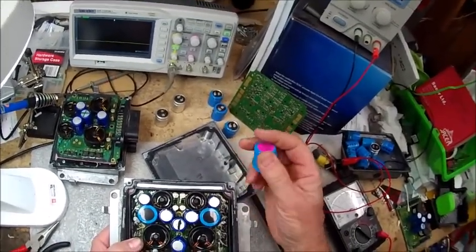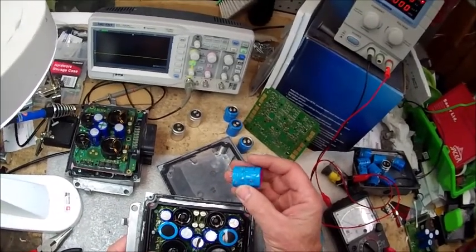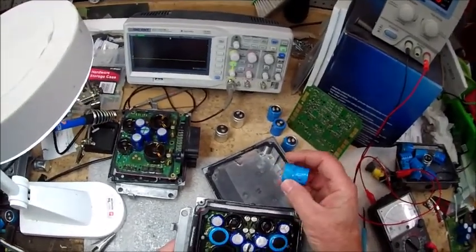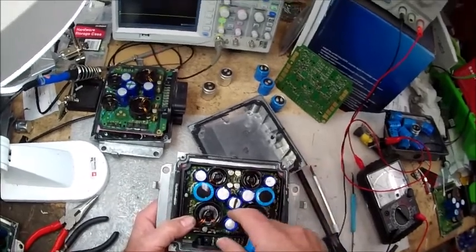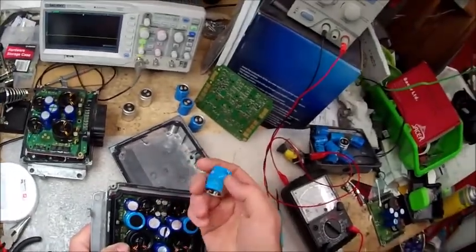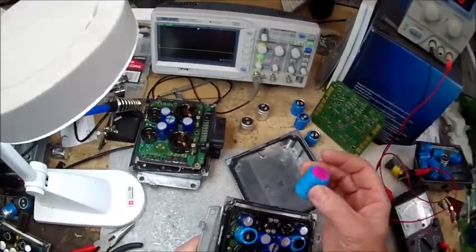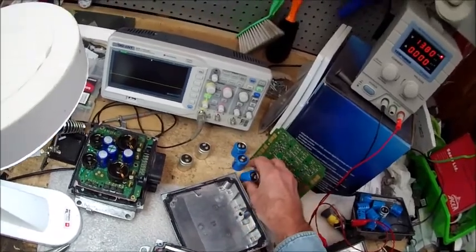The way these are designed - these are called electrolytic caps. There's a dielectric material that has been pressurized with an electrolyte gel, impregnated into that dielectric material, and then wrapped with foil in different layers to come up with the capacitance qualities you're after. When these things get hot, it's like putting insulation around all the parts to keep them hot - that's exactly what this gel is doing. It keeps that heat around these parts and continues to roast them even when you've got the car shut off. If the inside of these caps get so hot, that gel will actually start to vaporize, and we know when vapor happens you start to build up pressure. The tops of these are actually meant to split and open up - it makes the case bigger.